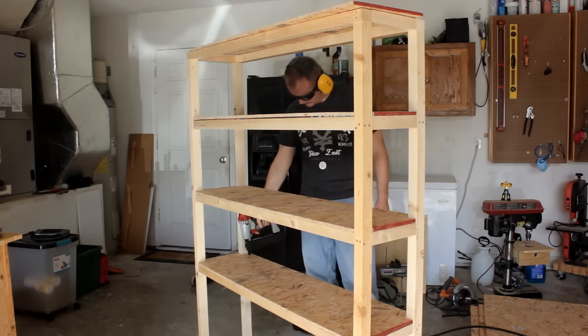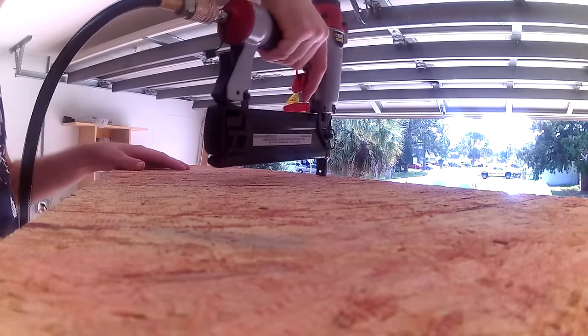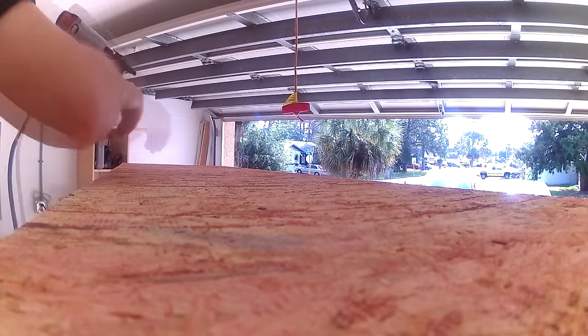After all that is done I'll just tack the shelves in place with a few brad nails. Because of the dimensions of my shed the shelving units I built are only twelve inches deep by four feet wide. If you build some that are bigger or deeper you may need to take stock of what you'll be putting on them and add an extra shelf support to prevent shelf sag.